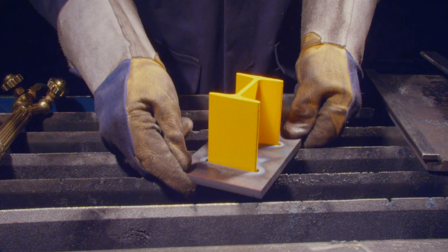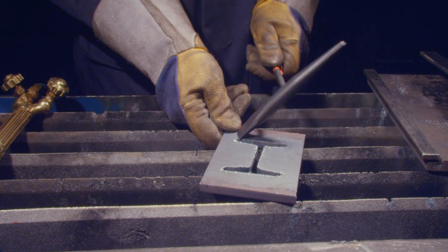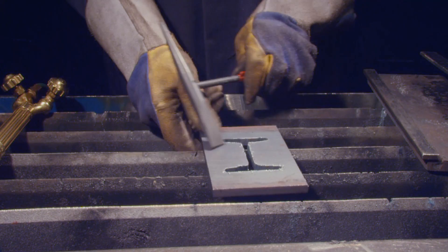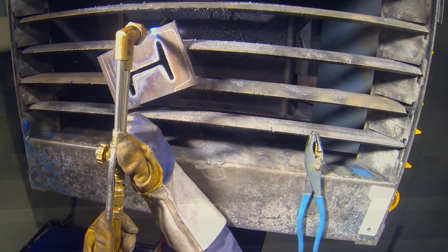This step is an excellent way of assessing your project. Gently remove the slag from the back of the project with a chipping hammer or chisel. If the torch is set up properly, the slag should come off with very little effort. You are now ready to cut a cope for the four inch channel.